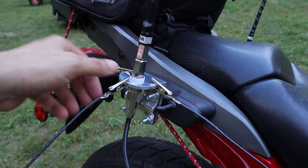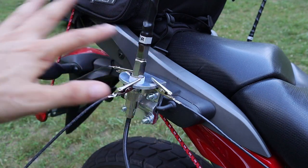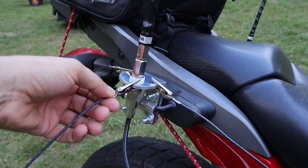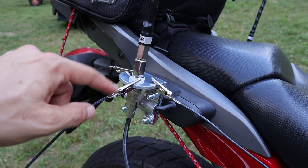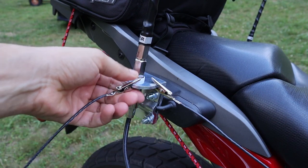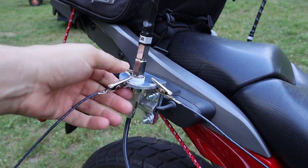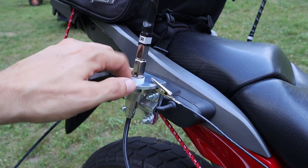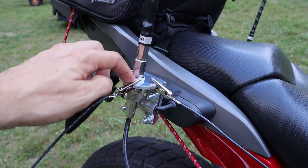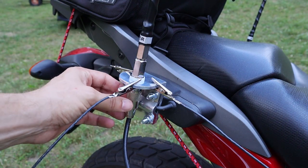For radials I've got three wires just alligator-clamped to the base of the antenna mount. These are 14-gauge wire with alligator clips crimped on — I'm going to solder them later tonight just to make sure they don't fall off, but this is a quick way to connect up the radials. I went with this configuration so I can just wind these up and quickly throw them in my tail bag, and when I stop all I have to do is unwind them, spread them out, and clip them onto the base.